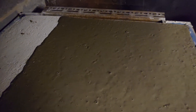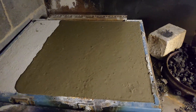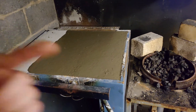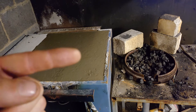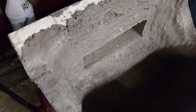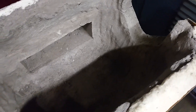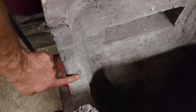A handy tip: if you're mixing up refractory, make a little mold and stick your excess in there. You can see all the air bubbles where we've tapped it gently so as not to settle the aggregates too much, but to release any air bubbles. After many stabbing wounds to the hand later, you'll see this is all packed in nicely - that's the thickness there, about 50mm.